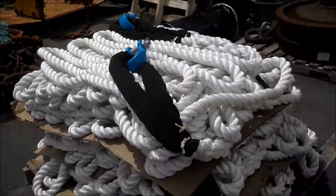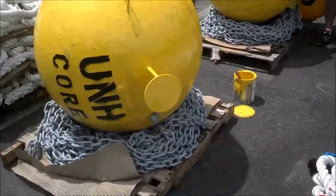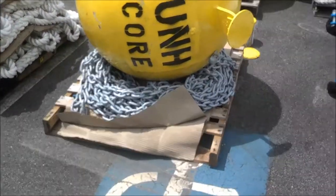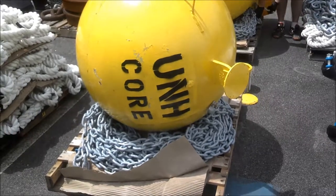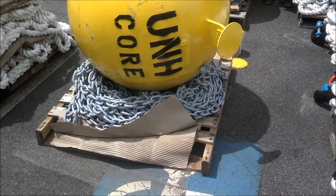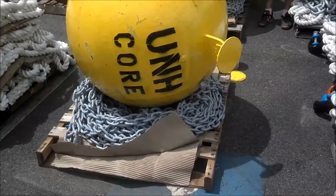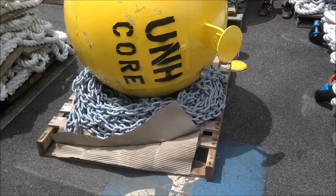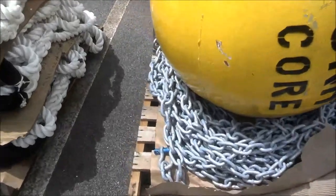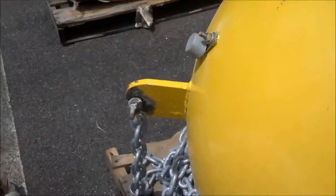For crown lines, the setup is like this. You can see on this one — that's the lantern mount. The 200 feet of half-inch chain is coiled on the pallet. You pull the mooring ball off of the coil of chain, then you can attach the end on top of the coil to the anchor, fake it out on deck, and use that to lower the anchor at the site, and then the ball goes in. All the connections on the end of these have been welded to deter any potential theft.